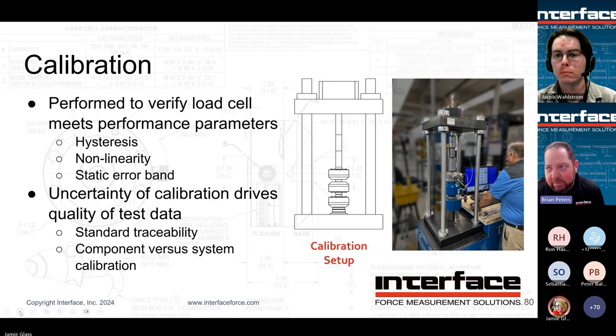So if you were to have two scenarios, one being very localized thermal changes, that can impact the load cell's ability to respond properly from a temperature compensation standpoint. Or if you have the scenario where you have a thermal gradient being introduced, say, through the load string, that may take time. Again, if the load cell doesn't stabilize thermally, then yes, you could have some less than complete thermal compensation happening from a bridge standpoint.